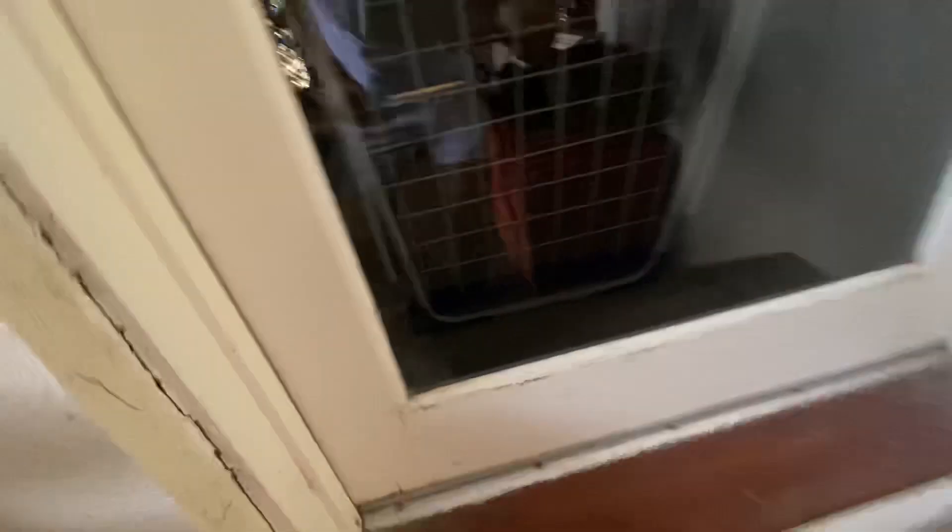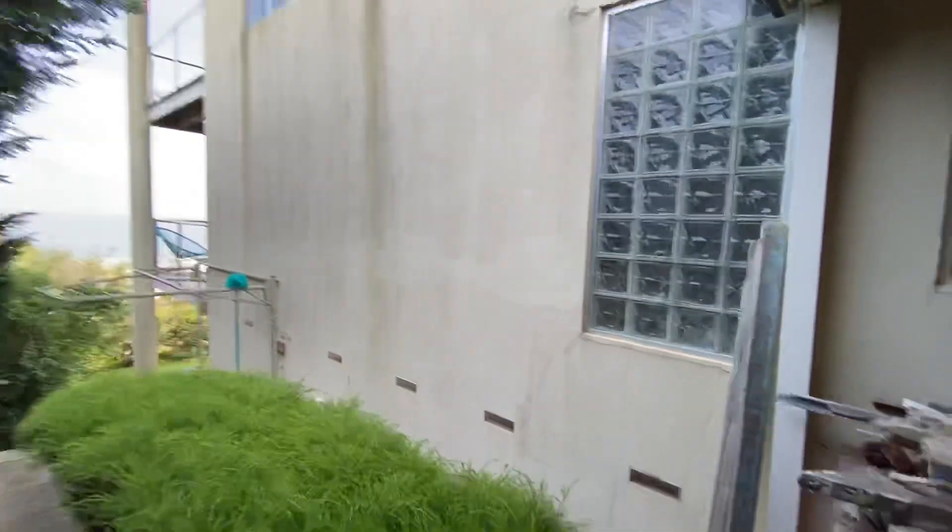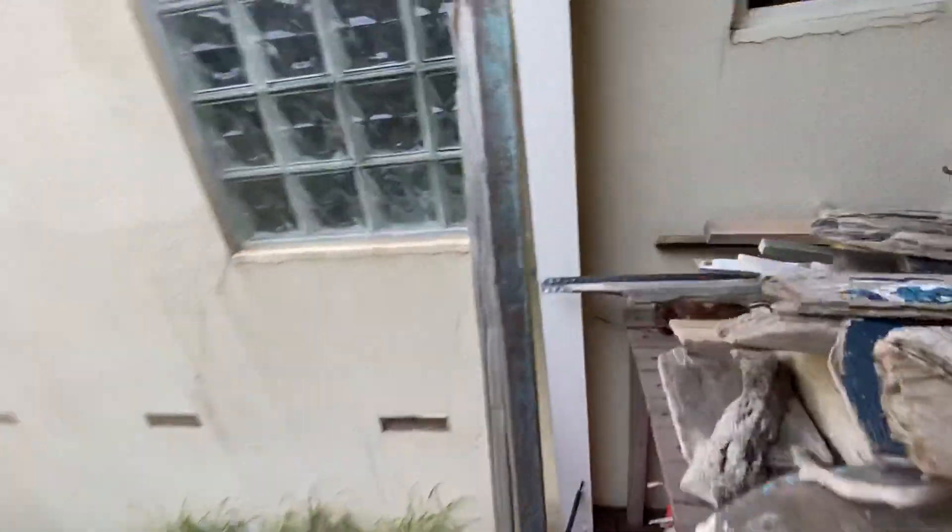As you can see, the painting has never been done properly - there is no undercoat on this woodwork, and the water is already seeping in and damaging a lot of your timber work. That can be fixed. Same thing on the render - it's creating cracks, and those can also be fixed. We have a special filler, a render filler, that we use.